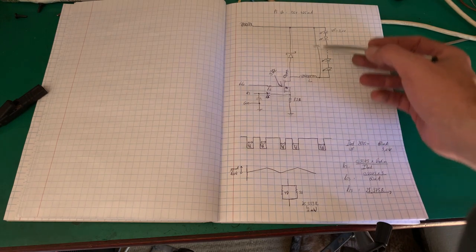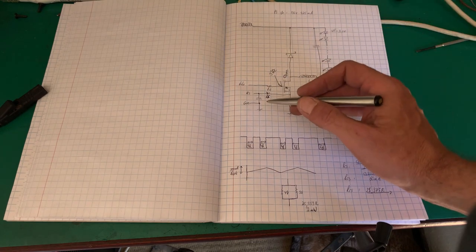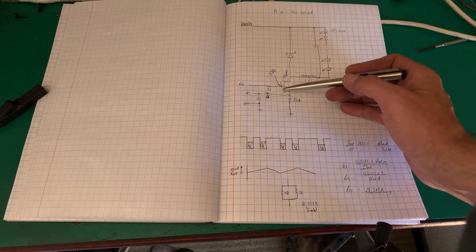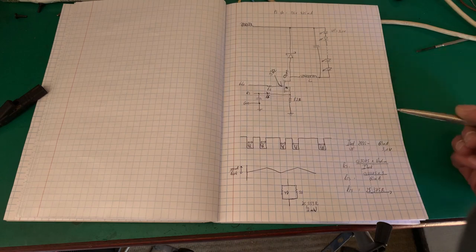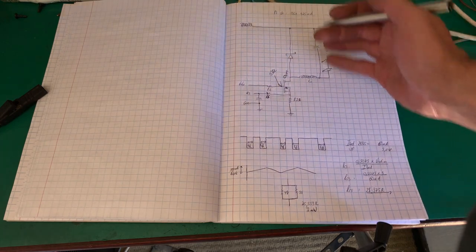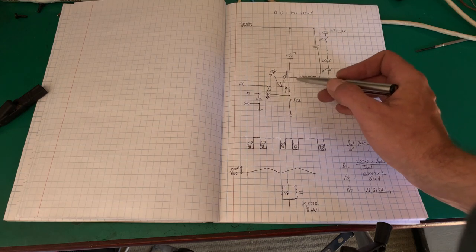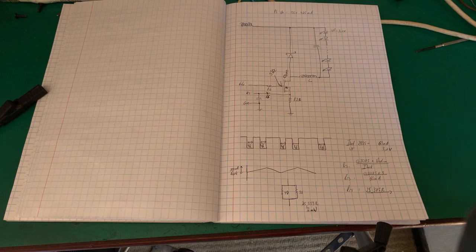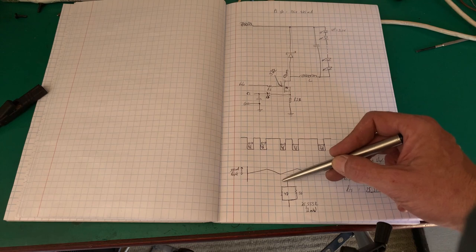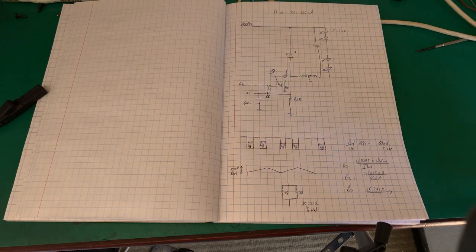So what we need to do is replace all the LEDs because, like I said, they are current driven devices. I'm going to replace them all in one go, then we start with new LEDs. We're going to change that resistor value to give us a current protection of 60 milliamps instead of 425 milliamps through the LED string, so that we won't burn our LEDs out. And we are going to have to change that inductor because that's swinging based on a 425 milliamp load. Now if we put 60 milliamps through here, definitely the current in the inductor is going to fall to zero, and that means we don't have a constant current through here. That means we won't have the brightness that we need, and a few other things.